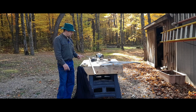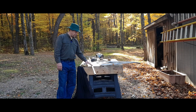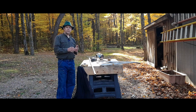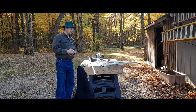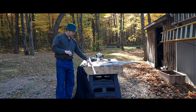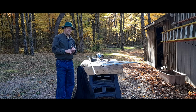I'm going to do 2 things. I'm going to secure weld the upper mast to the lower mast so that it's electrically bonded, and so that it can't lift off in a high wind event or anything like that. So that's one thing. I'm going to secure the 2 pieces together positively. And then the second thing I'm going to do is put on some reinforcing guy wires, stiffeners.